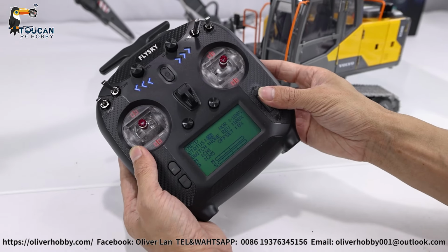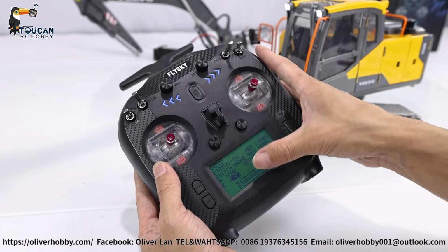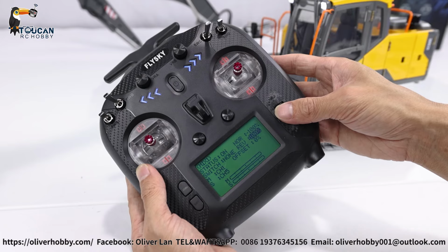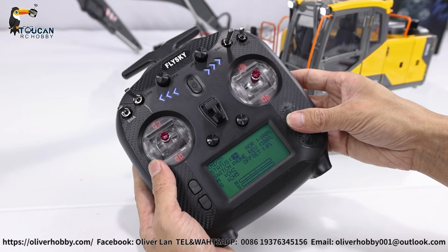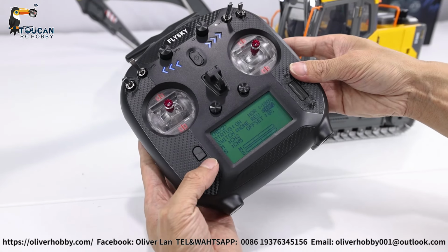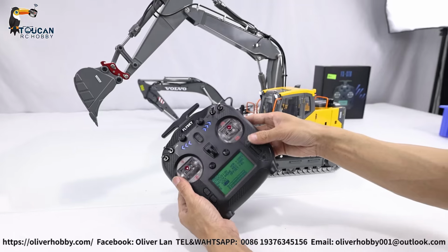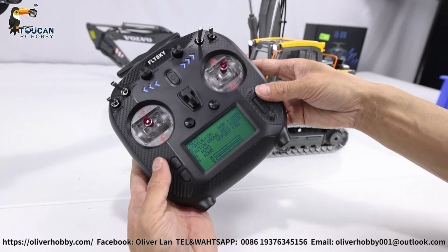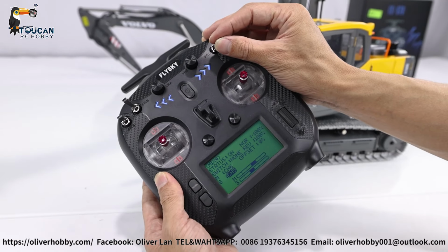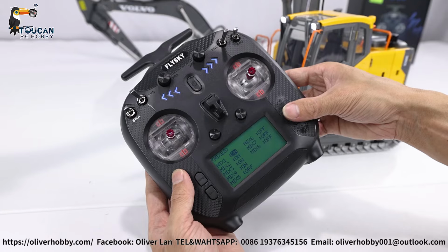Mix 1, on. And that's CH1 to CH5. Master, that's bucket, CH1. Slave, channel 5, the pump. So negative 100%. Reverse, it's negative, it's positive 100%, so that's different. And go to mix 2, on, CH2, big arm to pump, negative 100% and positive 100%. Mix 3, on, 3 to 5, front arm to pump. So same, negative 100% and 100%. 4, so here that's on. 6 to 5, that's middle arm, mix control the pump. So also negative 100% and positive 100%. So all 4 channels, it's the same settings.